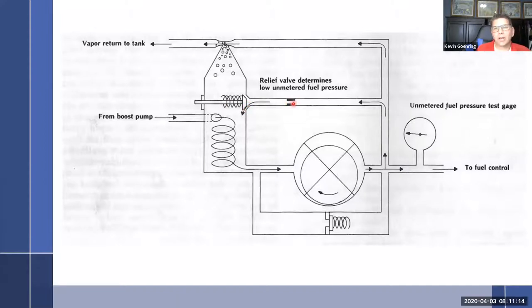As we know, if you have two orifices in a row, whichever is the smaller does the work. Whichever one is bigger is redundant and unneeded and useless. So this is going to open up to a point where it becomes completely useless, and now we run off of this. So this is the low end. And this right here is the screw that actually sticks out of the back of the pump that you can adjust: screw it in for higher output, screw it out for lower output.